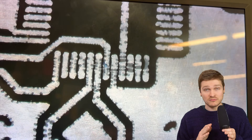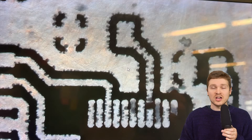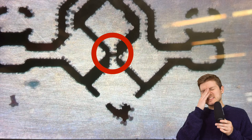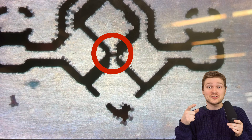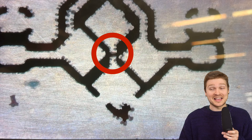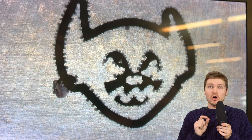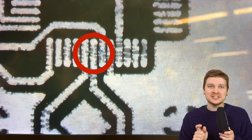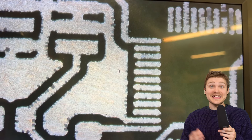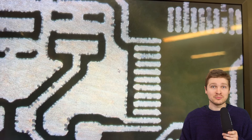It didn't actually affect the usability of the board - it reduced the thickness of the copper but never fully broke through, which was great. There were a couple spots where it had broken through, probably from film application issues or scrubbing too hard before etching. The worst break was right underneath the crystal - a big flat rectangular pad broken right there, which I had to bodge closed. All the pins on the STM32 were separate isolated pads - a few looked like they were just barely touching so I cleaned them up a little with an X-Acto knife.